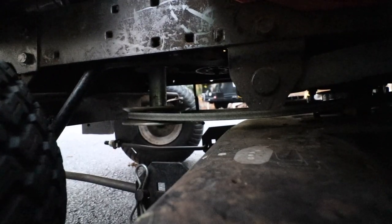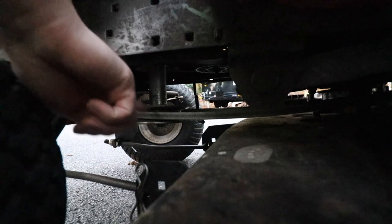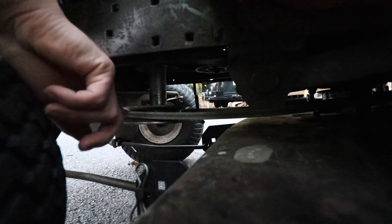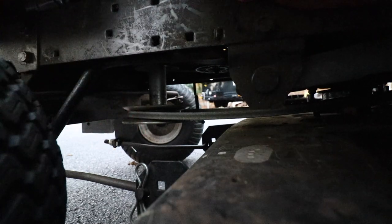especially something that has belt driven blades, whenever you're towing that leaf or push blower around, try and keep your blades on when you can, because the issue becomes, this is the main shaft off the engine, this is your belt drive system. What happens when you engage your blades is a pulley back on the deck puts tension on this belt, and friction is what engages this belt with this main output shaft of the engine.